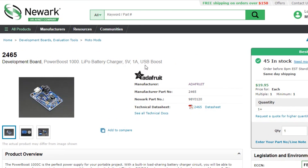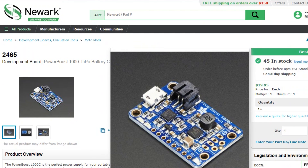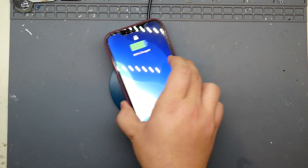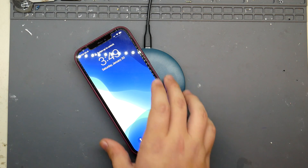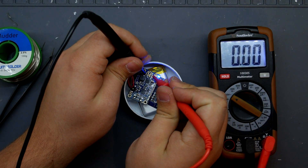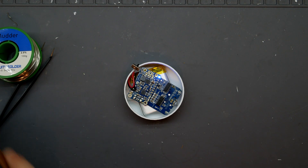This project has a pretty simple schematic. For any project using LiPo batteries, I try to incorporate some kind of charging circuitry. Since I've used boards like the Adafruit Power Boost that offer battery protection and charging, I didn't see the need to create my own PCB. The Adafruit Power Boost board I'm using outputs 1 amp, so this definitely won't be fast charging. This project wasn't about creating the most efficient battery for an iPhone — if it were, I definitely wouldn't be using Qi wireless charging. Since Qi is pretty much the universal standard for wireless charging, there are lots of premade PCBs with all the components needed to create an oscillating magnetic field. I picked up one of these Qi wireless charging boards and coils.